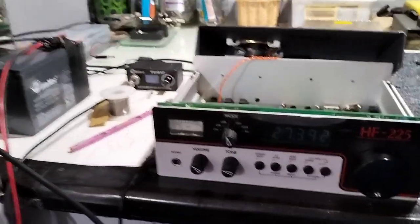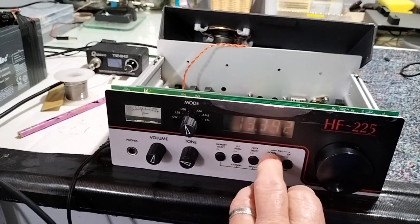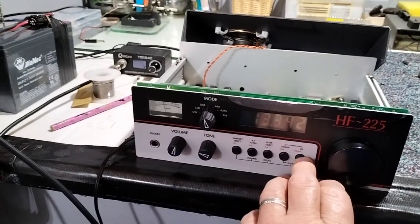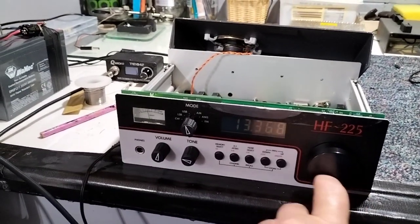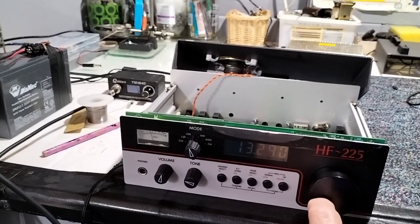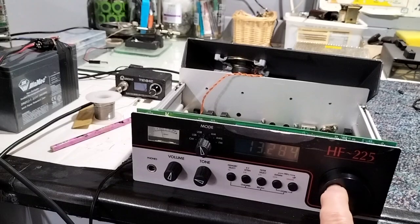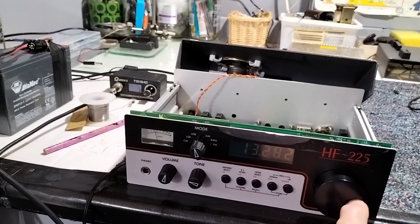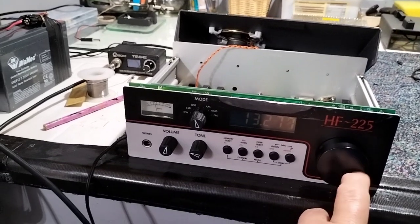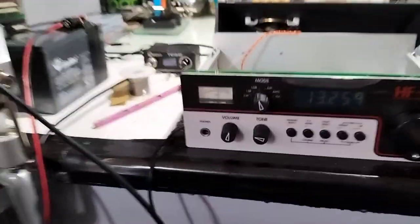As you can see, all the functions are there and the radio does work above 12 MHz. I'll show you what happens when you go below it. It's out of lock now — it mutes — and the S-meter goes up. So that's what it's doing.